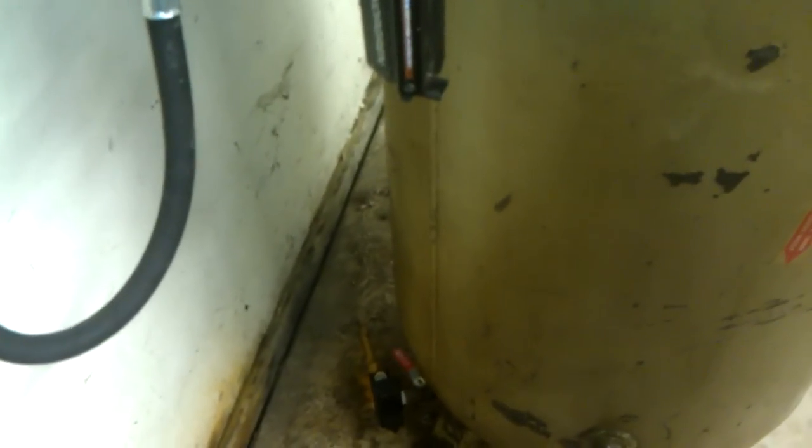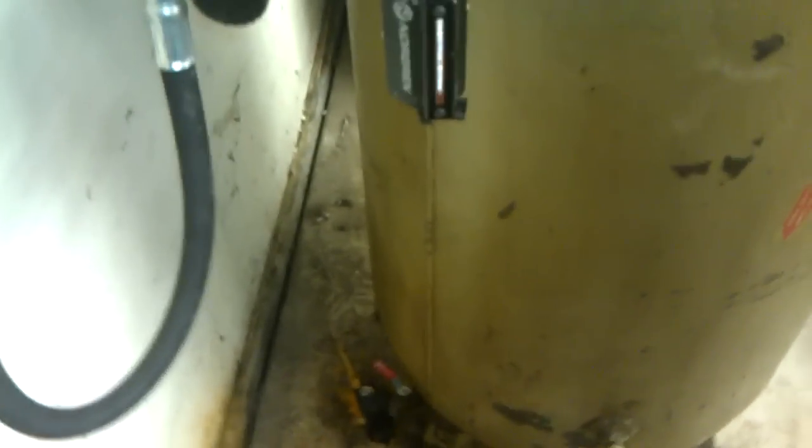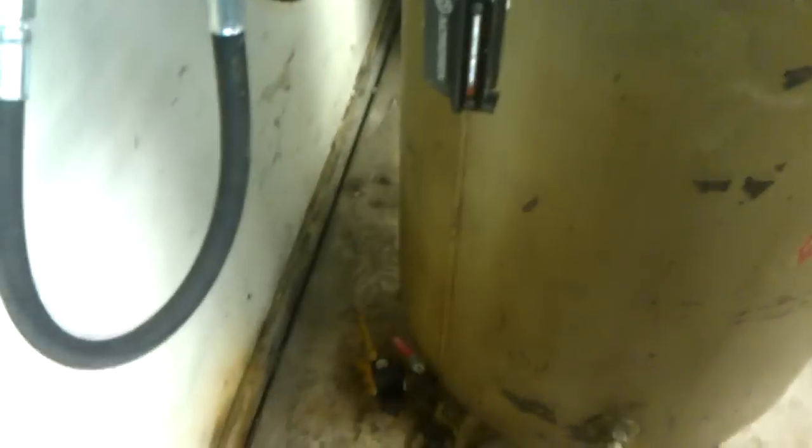I've never actually seen it done. Talking with an individual, one of my subscribers on YouTube, he was telling me that a refrigerated air dryer is on a similar principle but different. They typically have their own automatic tank drain, and if they do rely on a system tank drain for the entire system, there's a check valve in place to keep any differential pressure from backing up into the refrigerated air dryer.